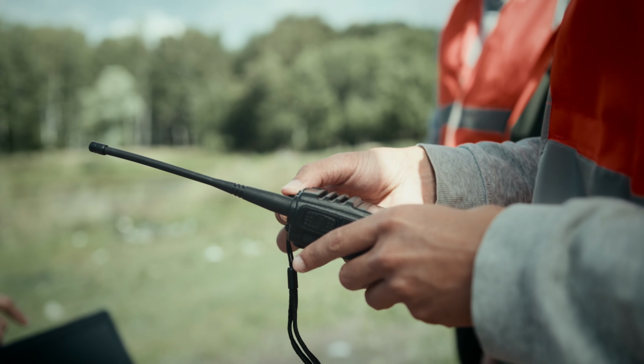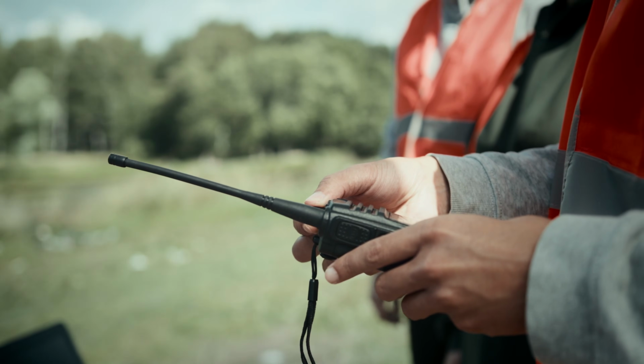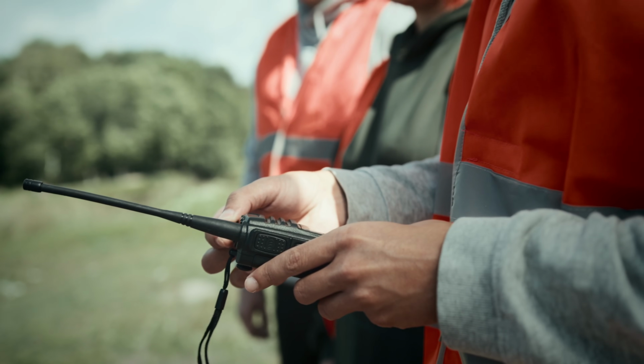This is due to different absorption patterns and paths the signal takes, and I tend to agree to at least some degree. The band is widely used for experimentation. There is even ATV, also known as amateur television, or ham TV as some call it, on this band, as well as on the 70 centimeter and 1.2 gigahertz bands. So this would be one of the three bands utilized by ATV. You will also see some traffic on different bands, but these are the three primary ones.